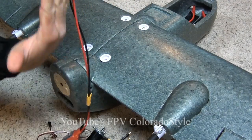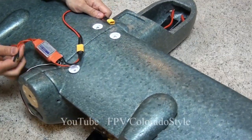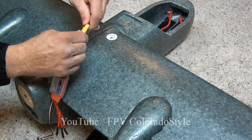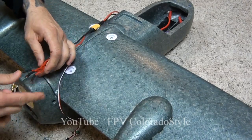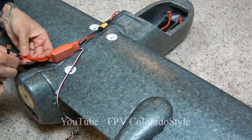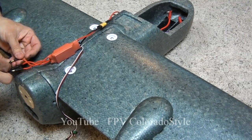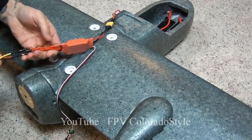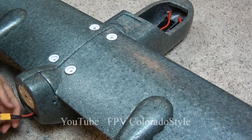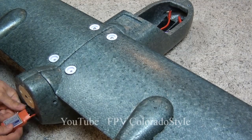I'm not going to use it for fun flying or anything. I made about a 12 inch extension — it goes from the back to the front; I'm not exactly sure what that is in centimeters. I made it so you can take it on and off. When I originally put this in I put it in to test it this way, and I did go back later and put shrink tubing over these connectors once I confirmed the motor was spinning in the right direction — over all those connectors so they would never come apart, especially in flight. I want to build this for long range and durability.